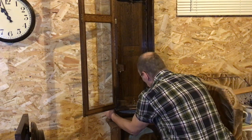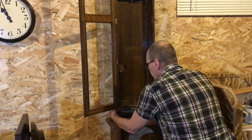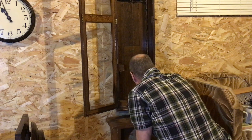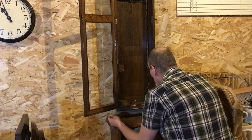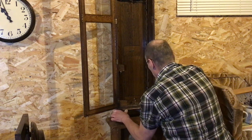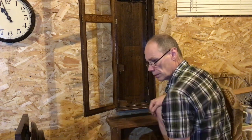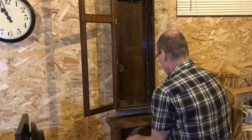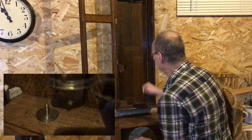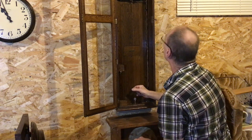Right, now this needs to go that way. Feel for the one that's in the wrong position. There we go. That's slightly wrong. And my piece of wood seems to just be in the middle. Like I said, this register's actually loose, but I can tell the mould exactly where it goes, so that's not a problem. Yours will generally be screwed to the case. What's happened is you've moved this and it's swung left and right, so this wood has rotated underneath. Obviously you can't see it. We'll come to that in a minute. Most of these have a little bracket that comes through here, which you'd have put on. I haven't shown you that because this block doesn't have one. What it does have is just a hole through the back for the countersunk screw. Right, it's still in the middle.